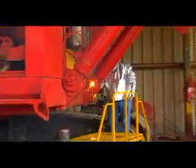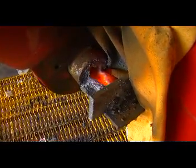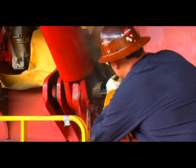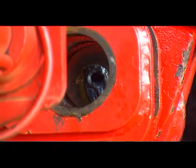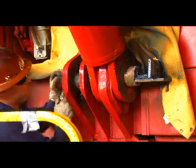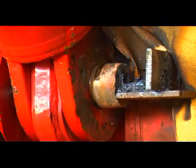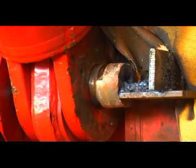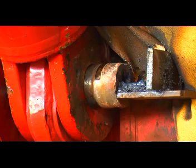Noise level testing by SMOSYS LLC shows that SureCut rods generate less noise during typical operations than other methods such as arc gouging, with an average rating of 92 dBA. You can allow the pin to cool naturally, or if water is available, quench the pin with water — quenching will cause it to shrink more than air cooling. Once cooled, the operator uses a 30-ton port-a-power to push the pin out, using spacers to provide the necessary length. Notice that the guide plate and shield are covered with slag, which would have been blown back on the operator if this system had not been used.